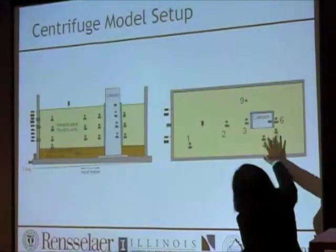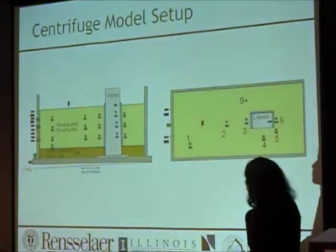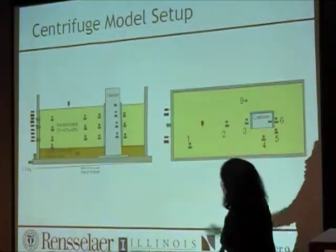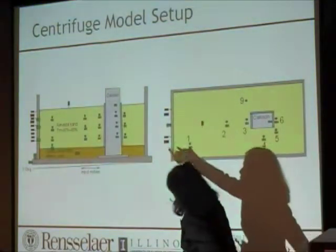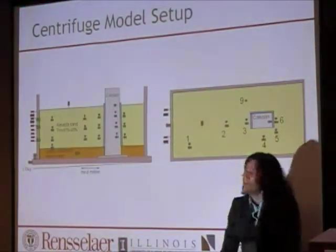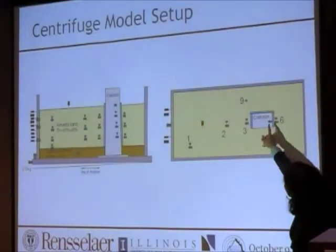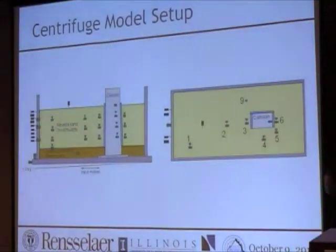This is a top view of the model with a whole bunch of sensors around it. The green ones are accelerometers and the blue dots are pore pressure transducers. At the side of the model, as mentioned, we use a laminar container — we have accelerometers there, we have LVDTs, and we also have laser sensors. We use laser sensors a lot at RPI because they're more convenient than LVDTs sometimes, but they have limitations: you can only measure a metal surface that isn't reflecting the laser beam. So we only use them for the sides of a container or to measure displacement of aluminum structures — you can't use them for soil sediment because water causes reflections.